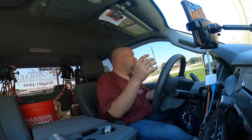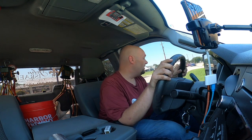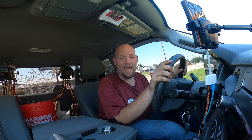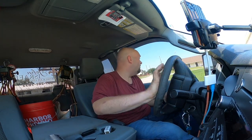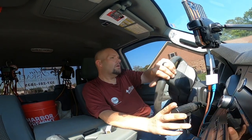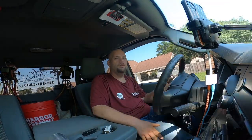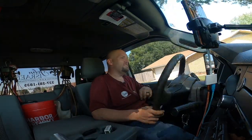Alright guys, so you saw most of the video was the downstairs unit was completely offline because the sewer trap was stopped up like I explained, and we cleared that out, and then we took the transfer pump and we flushed out the sewer line. It took the water no problem after I blew it out, and everything looked good on it. And then he asked me to check the Freon on the upstairs system because he said they put it on the other day and it was blowing, but it just wasn't blowing cold.